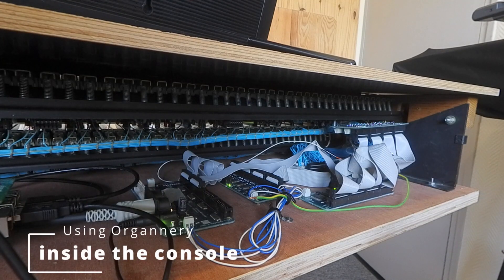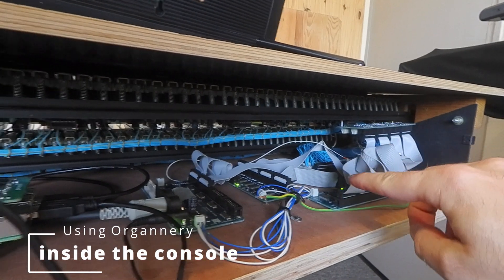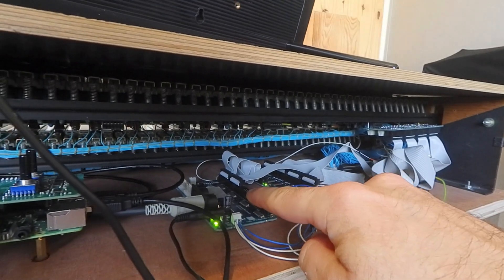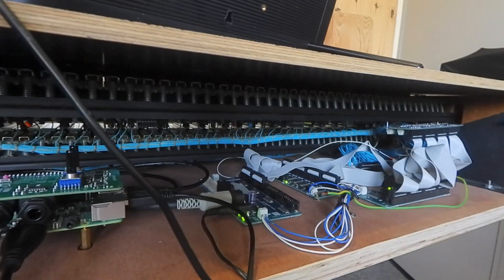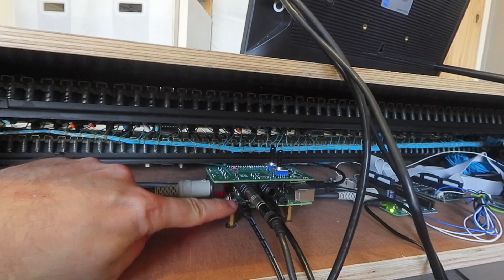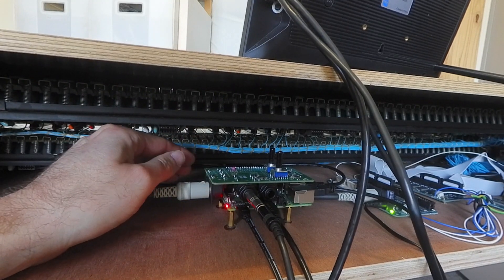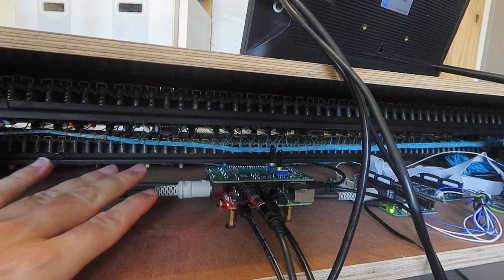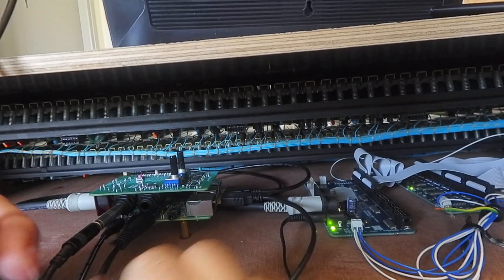Now if we take a look at the back of the console, on the right we have all the electronics to MIDI-fy the keyboards — let's call them the MIDI encoders — which come out through this DIN5 MIDI cable connected to our Raspberry Pi through the PiSound audio board. It's the recommended board for Organo; it has audio outputs as well as MIDI inputs. If you don't have DIN5 MIDI inputs and prefer to use a USB MIDI, that's fine — you just have to plug your USB keyboard to the USB ports.